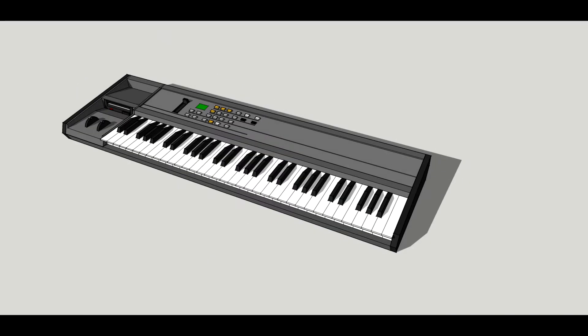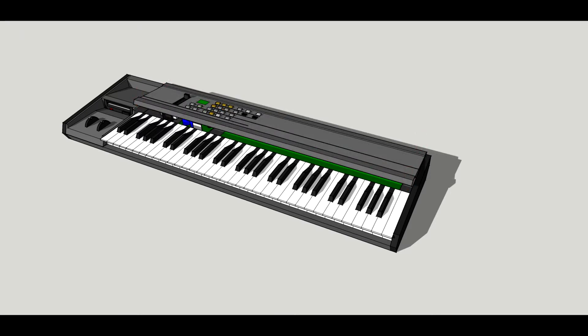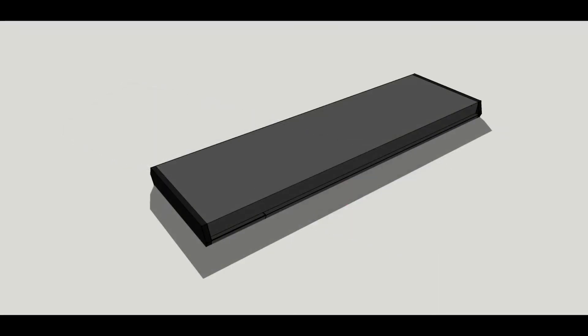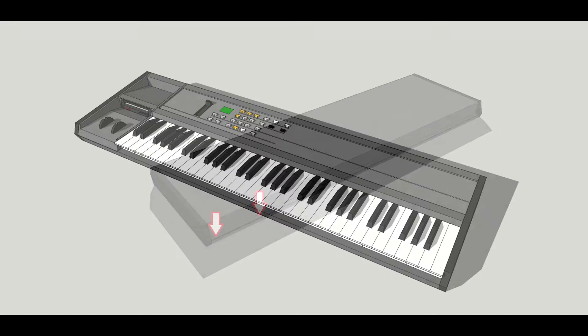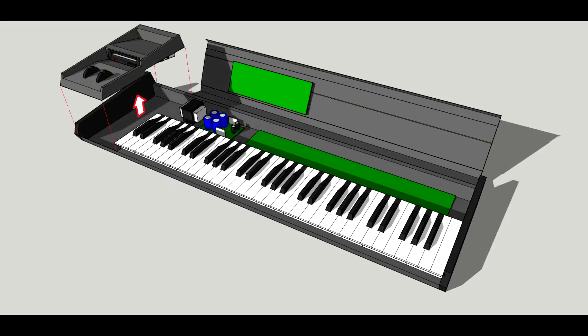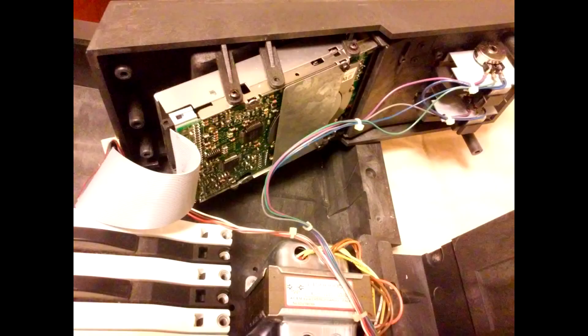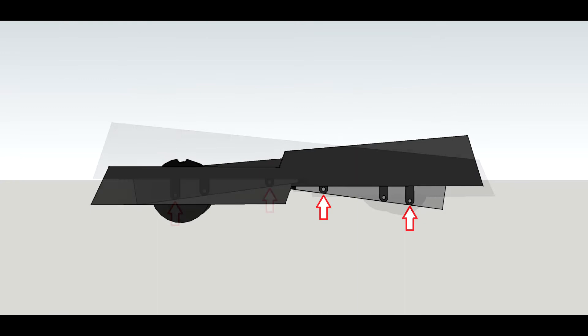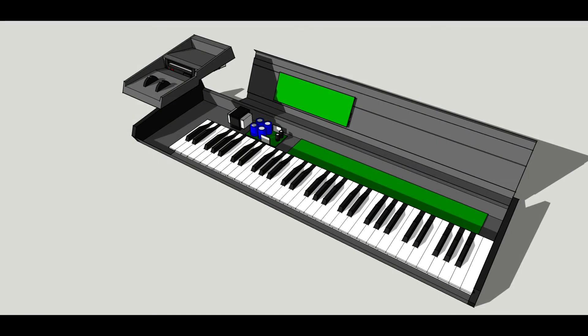The plastic DSK-8 model is slightly different. Remove the four hex head screws at each corner of the top lid and then open it. You may need to apply a small amount of force to get it open as the plastic is flexible and tightly fit into the case. After removing the four allen head screws from the front panel, flip the machine over and rest it on a soft surface. Remove the two Phillips head screws at the bottom right of the case attached to the control panel, as well as the two at the top right underneath the back overhang. This should allow the control panel unit with the floppy drive to lift free, giving you access to the drive. Be mindful of any zip ties or wire ties holding the control panel wires in place. Note the orientation of the ribbon cable and power cable and then remove them. Finally, remove the two Phillips head screws from either side of the floppy drive mounts. You should now be able to remove the drive from the unit.